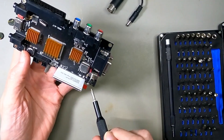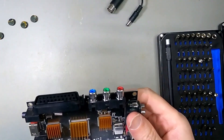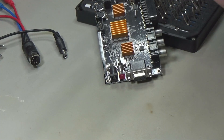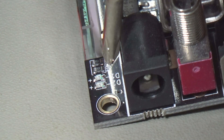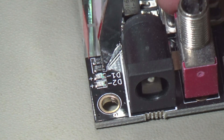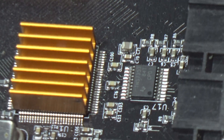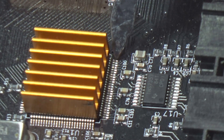There is a resistor down here that has to be removed, and then it has to be wired up onto one of the pins of one of these ICs. It says on this particular board it's an OSSC 1.7. So one of the things we've got to do is remove the resistor at R35, which is just this one. We've got to remove that resistor, which looks big on the camera but it's absolutely tiny. So R35 has to come off, and then we're going to put a wire onto that pad. That wire has to attach to pin one on U1, which is this pin here — you can see these pins are actually tiny. We just put a wire between there and this pin here.